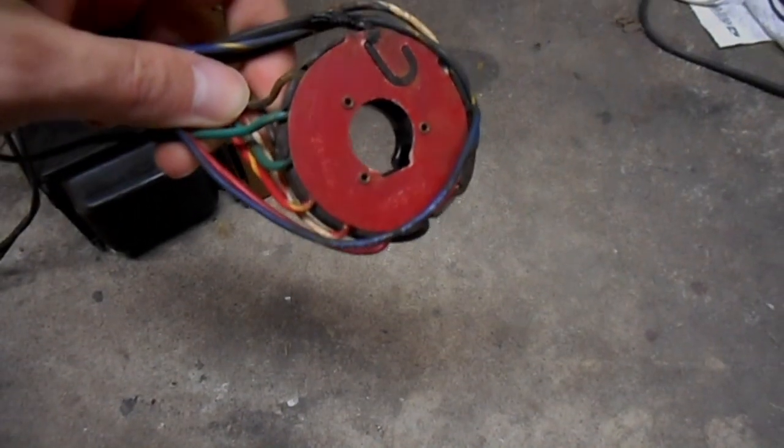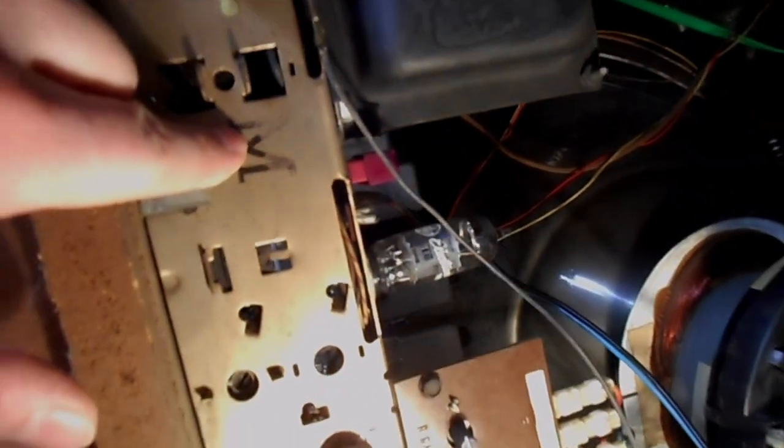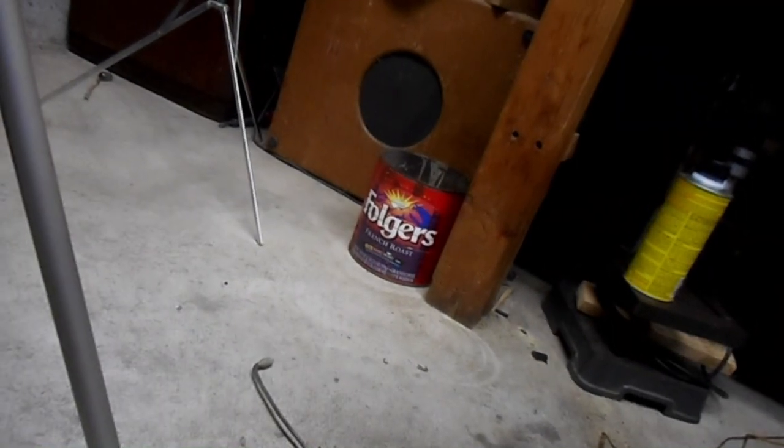It uses a black with red back style CRT base. This is the old style that they used on older chassis from previous model years. Also, I noticed that the older one has an R stamped near the circuit breaker, and the Z chassis has an M stamped near the circuit breaker. I think those are chassis revision numbers, or perhaps some other indication. Otherwise, above chassis, they're basically identical.